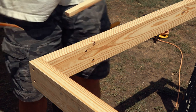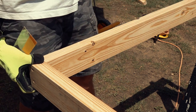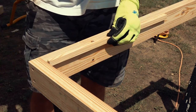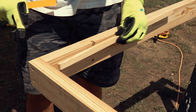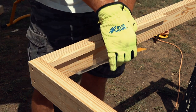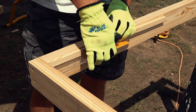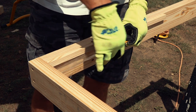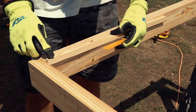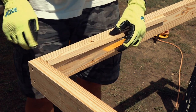I'm back at my outdoor workshop — the lighting is a lot better here. This is one of the window frames; this is the outside. What I'm going to do now is attach these stop blocks flush with the outside. Then the window pane will sit against the stop block from the inside, and another block will be attached on the other side. So the window will be sandwiched between those two stop blocks, and then I can caulk a bit over here to make it watertight.